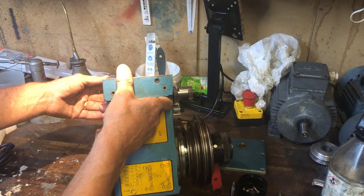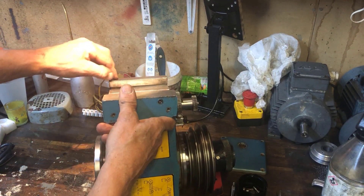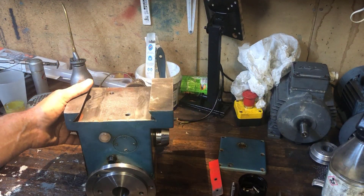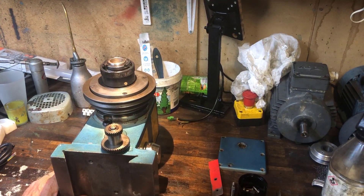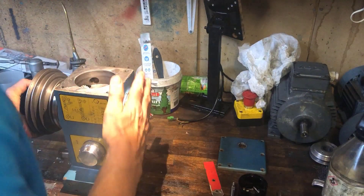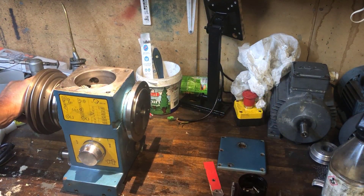Maybe two to five points per inch, as we've been taught, is enough. I see that this side is quite okay, really. But I have to test this surface. The reason I'm doing this now is that I need to mount this before I finish the saddle scraping, so that I know that the headstock alignment is true to the bed, and so is the transverse or cross-feed travel.